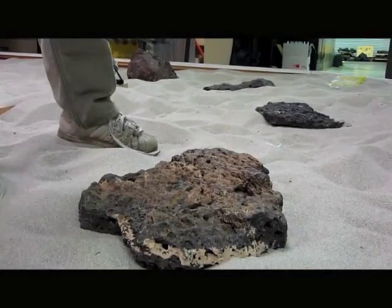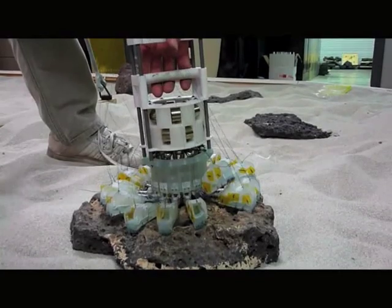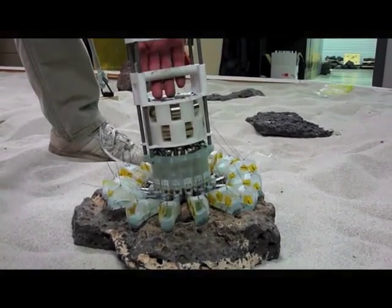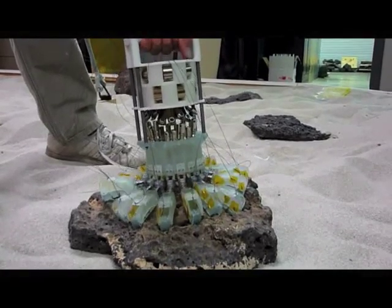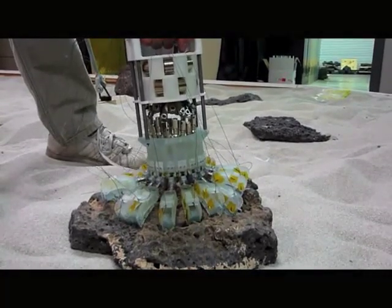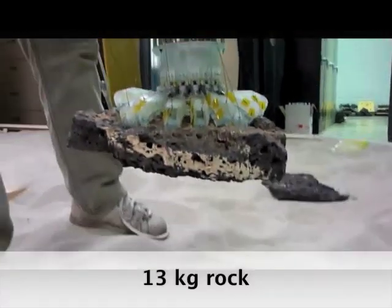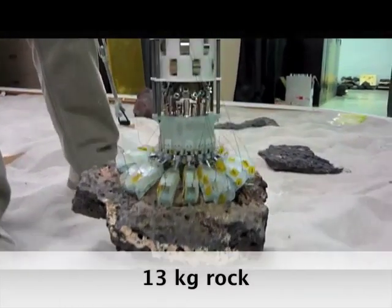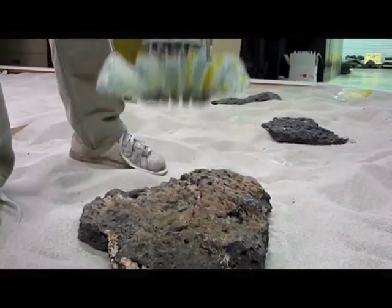Anchors use a new hierarchical configuration of microspines, with 16 independent carriages each housing 12 microspines. Torsion springs bias these carriages into the rock surface, and an engagement degree of freedom drags the spines across the rock, establishing an anchor — seen here lifting a 13 kg rock. A disengagement degree of freedom releases the anchor with less than 10 N of force.